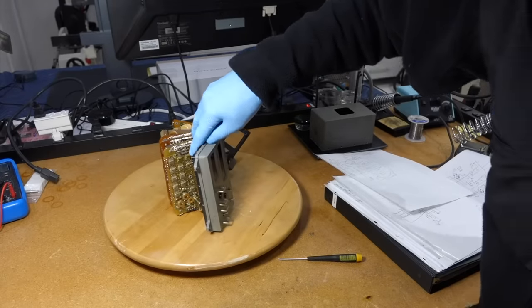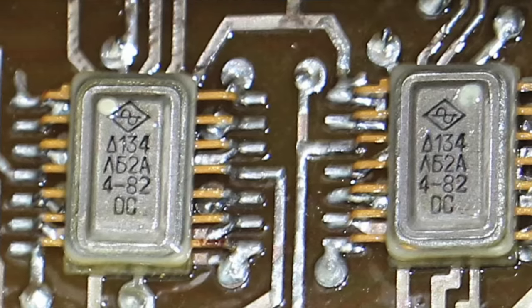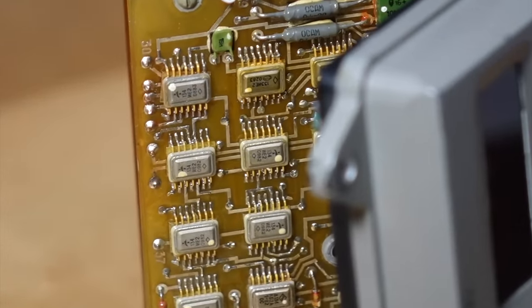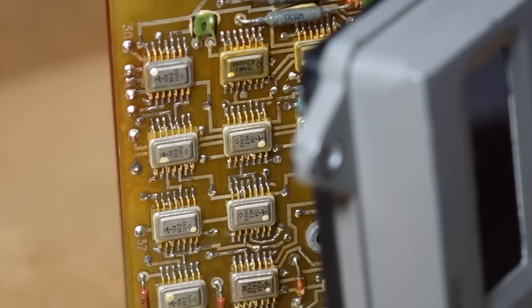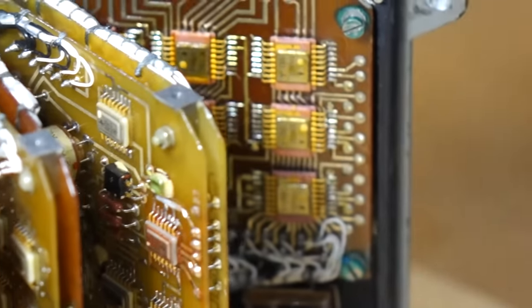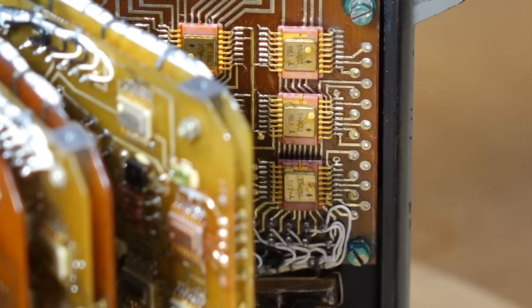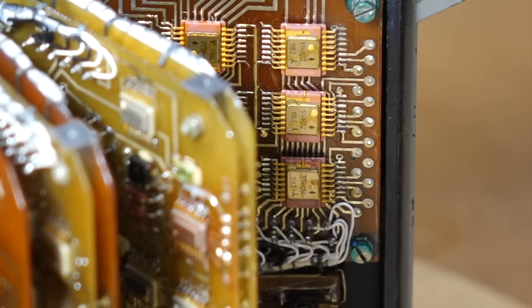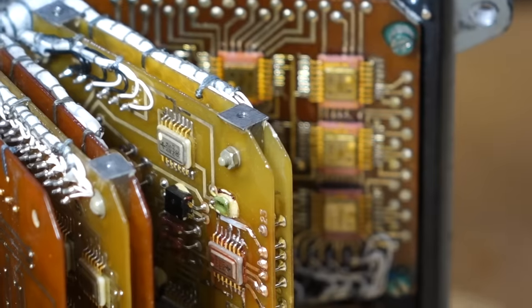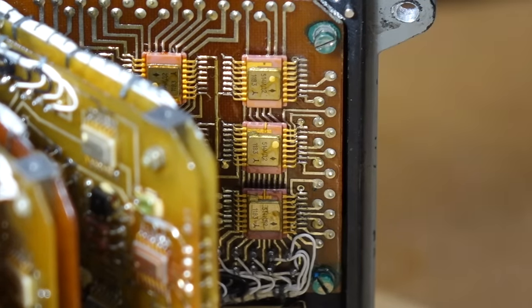So the integrated circuits, most of these are metal lid surface mount. These are TTL chips, similar to the 7400 series, but Russian versions, all labeled in Cyrillic with some Greek letters thrown in for confusion. These ones have pink plastic packages, which are kind of unusual. Somebody said it was beryllium, but I don't know if I can trust the comments. I would not believe it's beryllium. I've never seen pink beryllium. But even so, I'm not going to taste the chips. I have circuits in purple ceramic from the US. Well, this looks like plastic rather than ceramic.